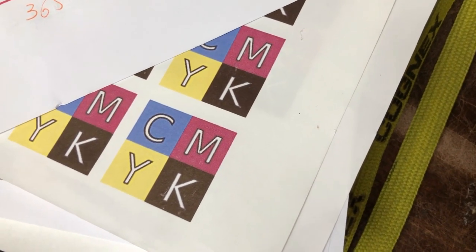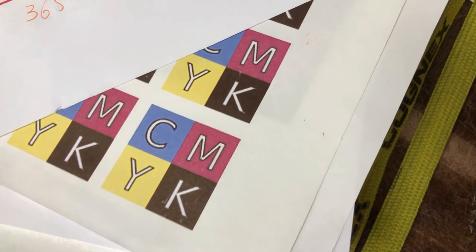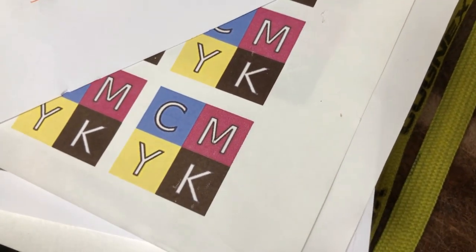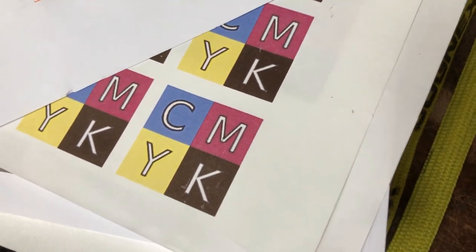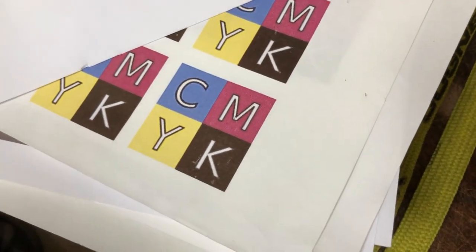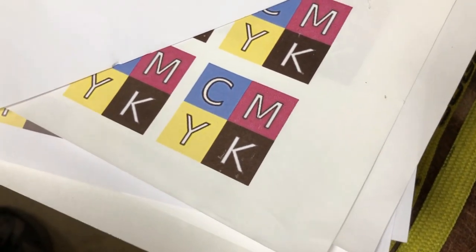The result of under-sublimation will be a brownish color. However, if the heating time is too long, the already-transferred black will transfer back, which we call de-sublimated, and the result is also a brownish black.